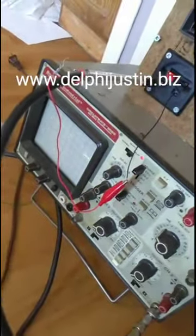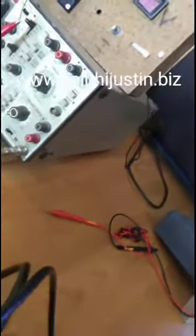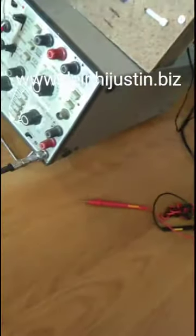What you'd probably have to do is cut part of the cord off, get a tiny metal box, and solder it on there to keep the RF out, and then put the resistor on there. You could probably do it though. I'm not for sure if it'll actually work, where the oscilloscope can actually measure stuff, because there might be a limit on how much minimum current goes into the oscilloscope for it to read the voltage. Because the 50 meg, that's pretty big. That's almost insulator-like resistance.